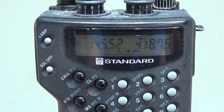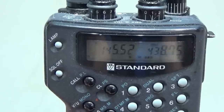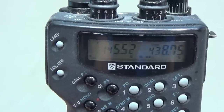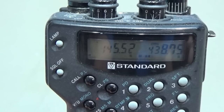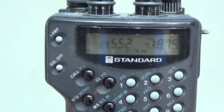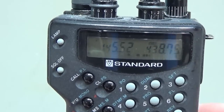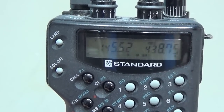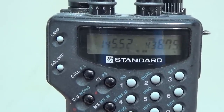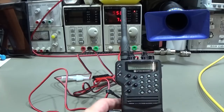But when you have a radio or any electronic device connected to a power supply for a longer time, as long as the capacitors are not totally dead, they try to heal. So they try to get back to their performance. And that is what we see here as well. So the flashing is gone, and therefore we could assume, oh great, it is running, it is good. But it is not. Still, we have a lot of bad capacitors, and therefore let's start this restoration job here. Yeah, and that is how I had it run here for several hours.